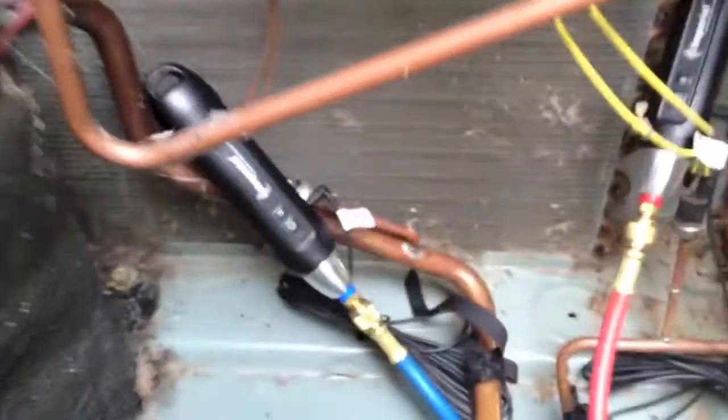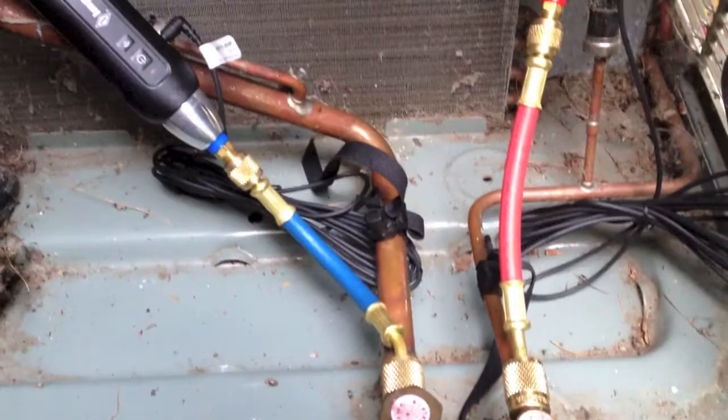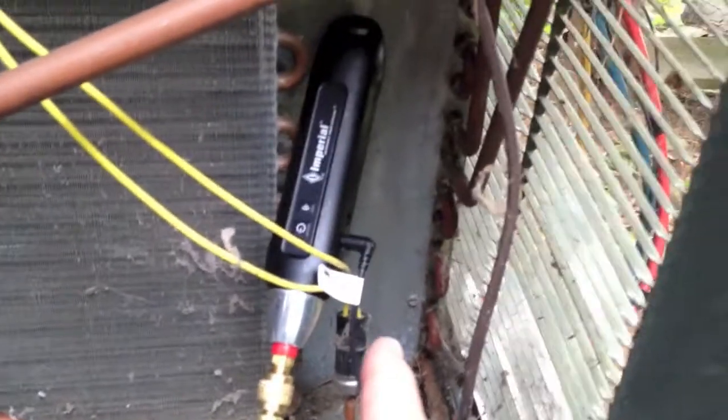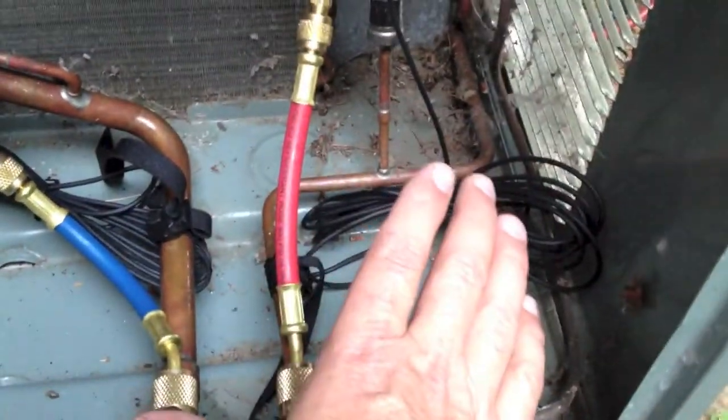You can see right here I've got the wireless low pressure probe attached. I've got it tied into the low side of the system with a low temperature measurement — that's just measuring off T1, so I've got it plugged into T1. And I've got T1 on the high pressure probe plugged in, connected onto the liquid line, and connected to the high side. So we're actually measuring the suction pressure and the high side pressure wirelessly.